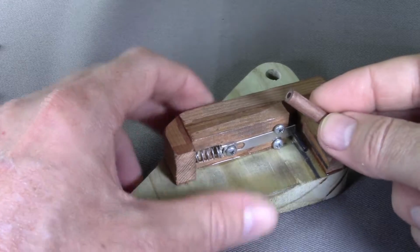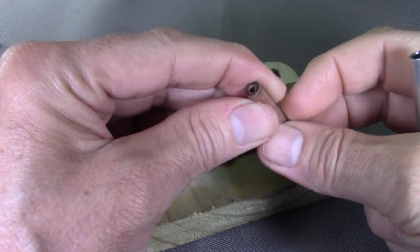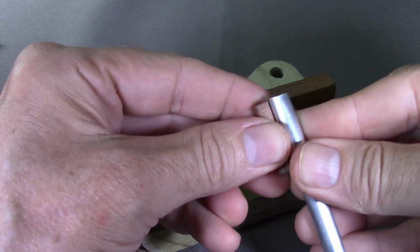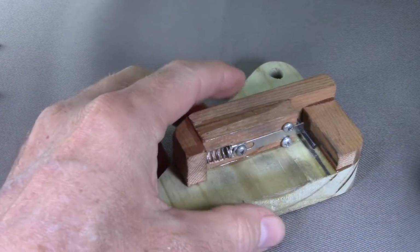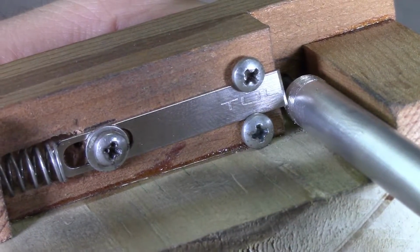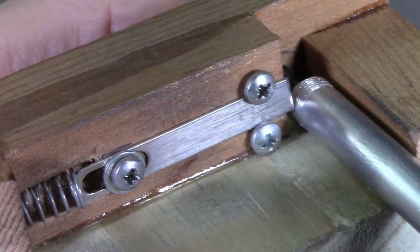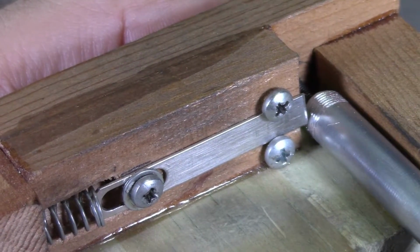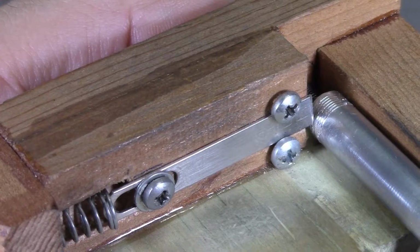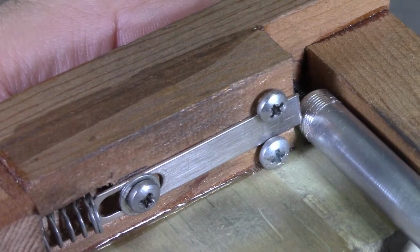The wood dowel, which is made from a cut-down pencil, gets inserted and lightly glued into the end of the aluminum tube, and a hole is drilled in the dowel's center so it can be threaded onto the screw. Threads are cut as the tube is worked back and forth along the screw. The wood dowel is then punched out once the threads are cut. It does a pretty good job with some care.